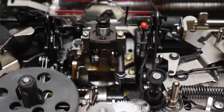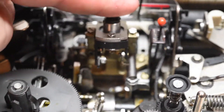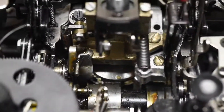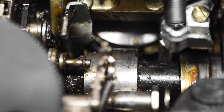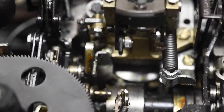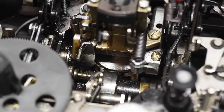The other part is the actual movement of the head. When you're actually striking a letter, the type ball is going right here — it's going to want to go up. What makes it do that is a cam that's actually located right here. That cam actually moves up and down depending on how this rod is twisted. As it twists, it actually sends the cam rotating this way and makes the head go up. Now all of that needs to be lubricated.